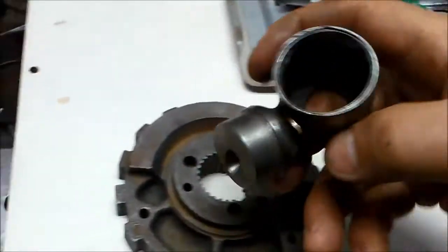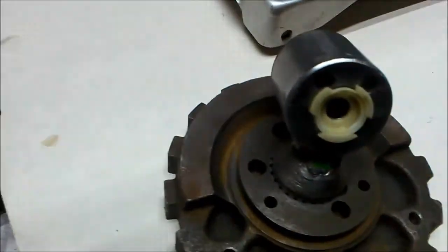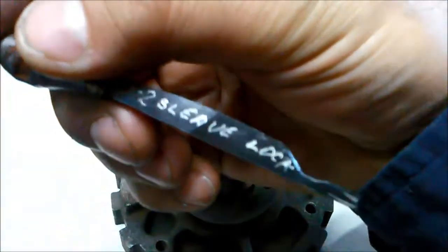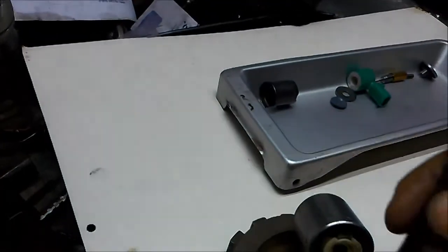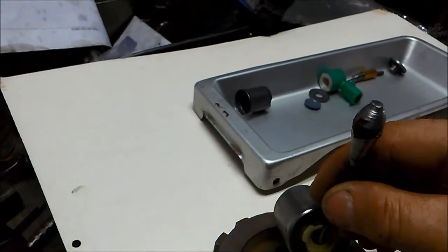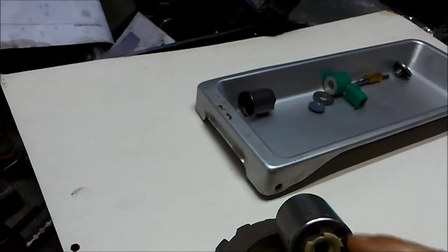After that's been done, we get this tool, place it in here. We take out the manifold and put it in there, and we use this little punch. You can see we've got the 3-2 sleeve lock, and we just gently put it in and give it a really light punch — just not to damage the plastic — in 3 places.